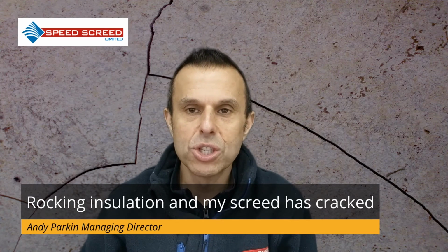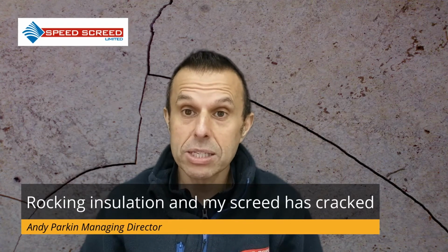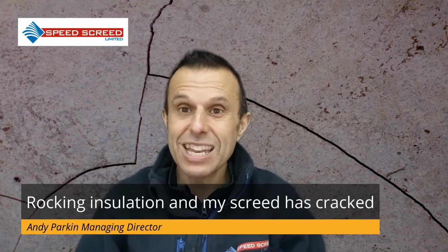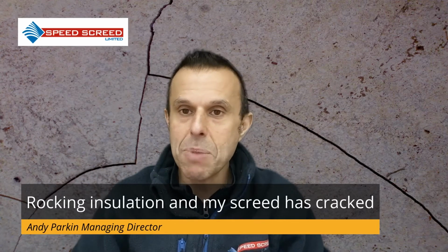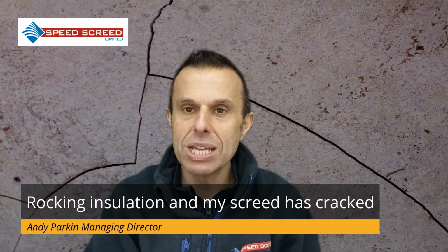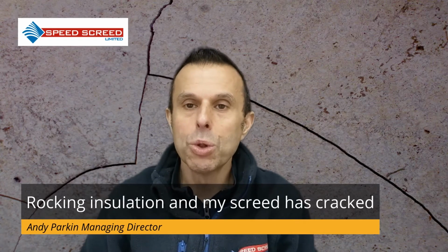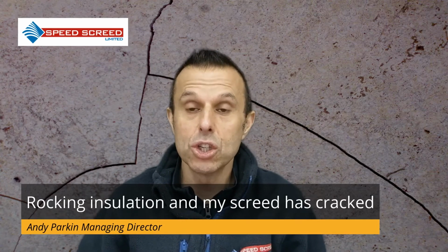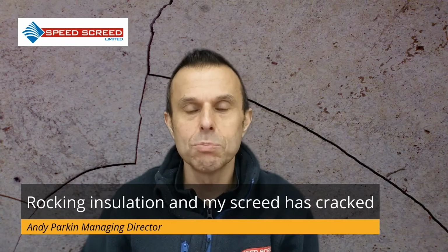It's very difficult to say whether the screed should be taken out, because you could repair those cracks. But if you've got issues underneath, potentially it may not resolve that. You may be able to use a repair mortar, or a low viscosity epoxy resin that you could pour in to repair those cracks. If you've got isolated areas, you can also stitch the cracks to add some stability.